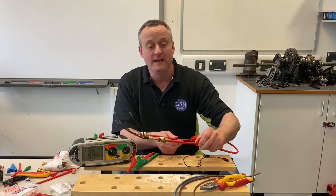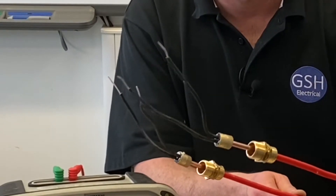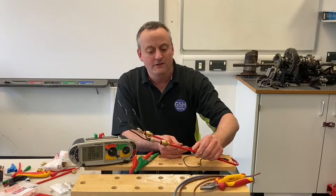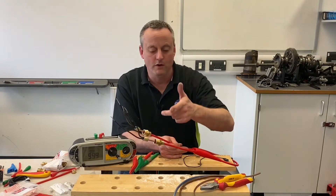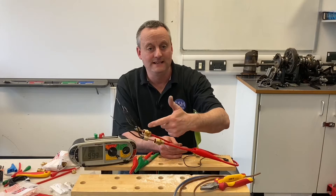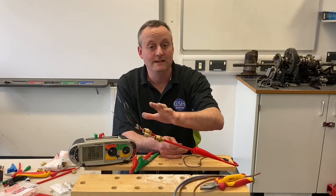The cable we've got in front of us has both ends made off. The learners sitting with me — we're doing it in front of a live audience again. They saw me make both ends off and got in nice and close to the second one; they had the first one on video. So they know we've made these off correctly. We've carried out the insulation resistance test and proved that neither end has gone down.